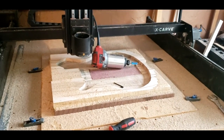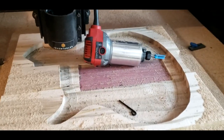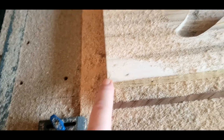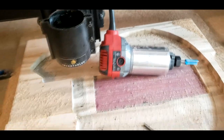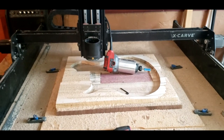We're halfway through the cut and the router burnt up. This thing started smoking and making all kinds of noise, so now I've got to replace it. I've got to get the center starting point back, then run it all the way around the whole cut just to catch it up, because I had to hit the emergency stop button. That thing was literally shooting fire out of the top of it. Didn't have the camera on me or my phone. But it is what it is — let's swap it out.